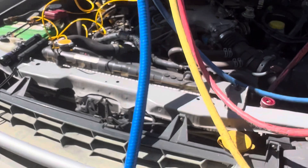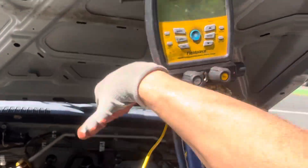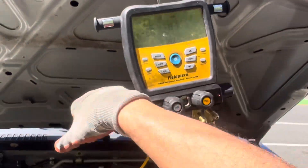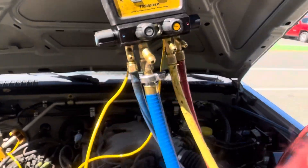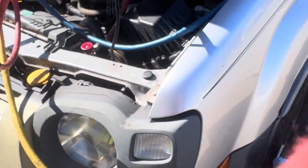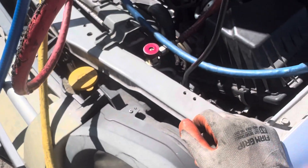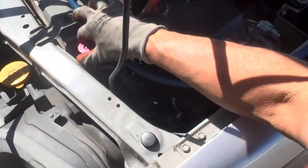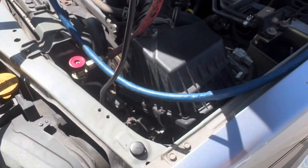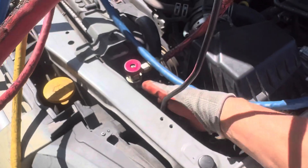That's why my hoses are always clean and dry — periodic high-pressure alcohol and nitrogen blowout to clean them out occasionally when needed. Close that, open that, open that, and while I do my paperwork I just leave it on here. It's the last thing I disconnect — let it get all the way down and clean. That's it on the Xterra: dry nitrogen, not shop air, and we'll need a line and a receiver dryer and go from there. The compressor spins, but the leak is so big I can't even test the rest of the system. It's not a matter of tightening — the line is messed up.